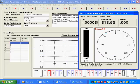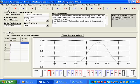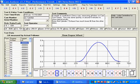I measured it with screen recording off and it went fine. You can see it automatically jumped to exhaust number one. Also, pressing F8 jumps back to the previous cylinder and F9 jumps forward to the next. Here you can see the data drawn from the recorded profile on intake one. The intake centerline we told it we want is 102 degrees — it's actually 101.99, a hundredth of a degree off, so essentially at 102 degrees. All the other lobes we measure from now on will be referenced from this point, how the program has zeroed out the rotary encoder, showing lift, duration, and all the other critical information.